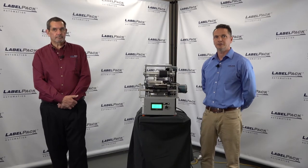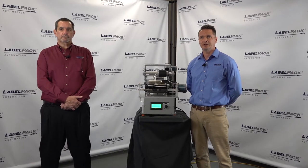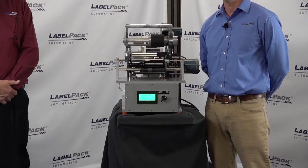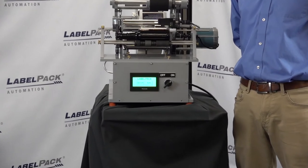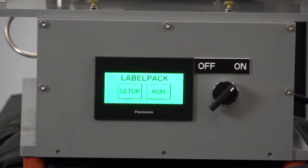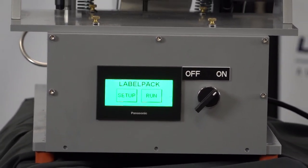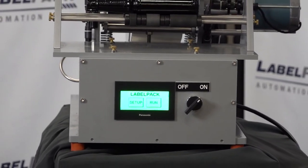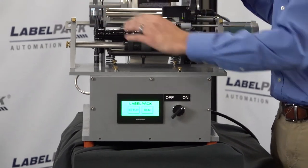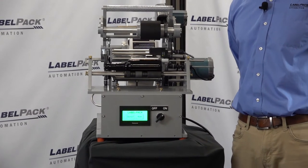At Label Pack all of our controls are made in-house. We have an onboard PLC which can be tailored to whatever preferences you have at your facility — whether it be Allen Bradley, Panasonic, or Automation Direct. We incorporate a user-friendly touchscreen HMI which comes in a variety of sizes, mounted directly to the front panel so you can easily make changes. Each of the timers is easily changed from the HMI, we can provide recipes making changeover easier, and we can add additional options such as a parts-loaded counter and label front and back. Pulling down the wrap assembly engages the ball switch, and the label feeds and wraps at the same rate ensuring a smooth finish while the timers adjust the label length.